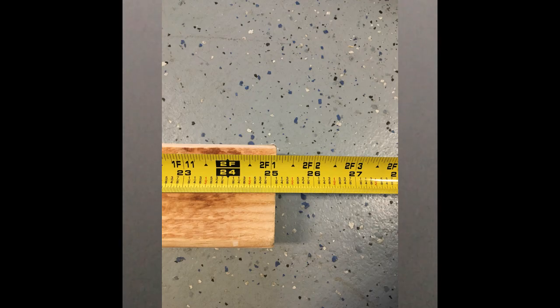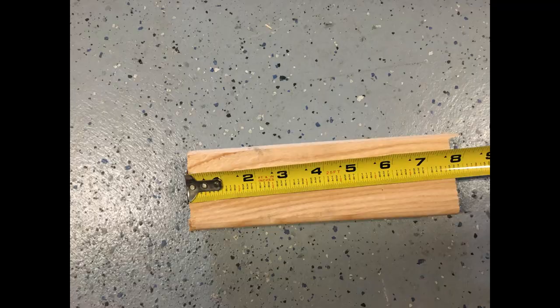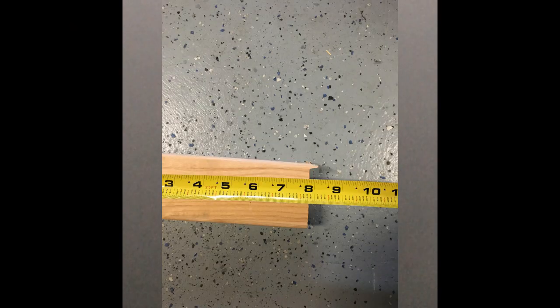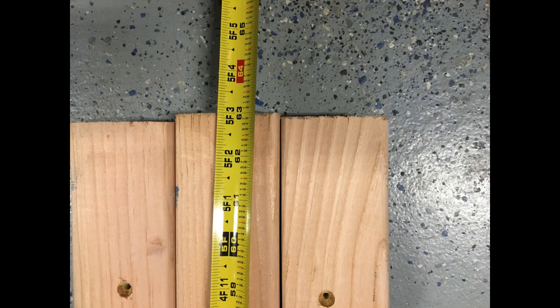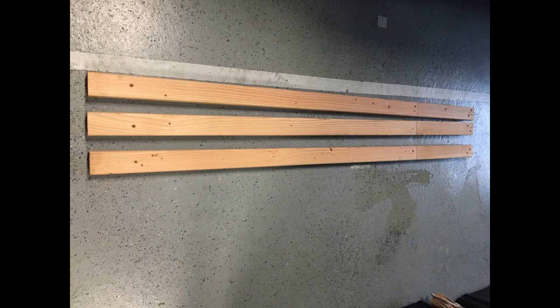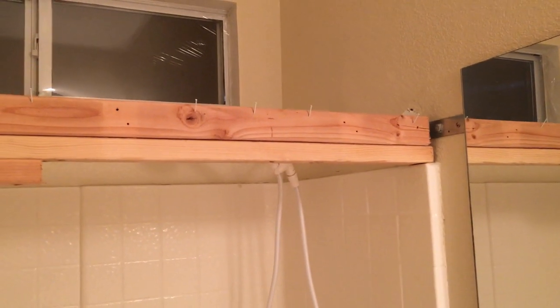Here's the other left side of it, and that goes up underneath. Then I have another piece that's going to go in the middle — it could just be roughly eight inches. These are your lengths. These are the studs going down. In my case I used three studs — they're all two by threes. It's a little bit cheaper and they hold up the same support weight in this case.